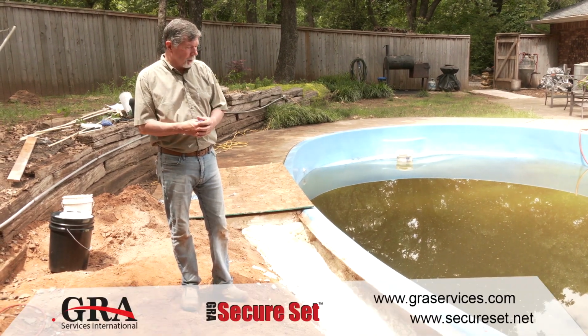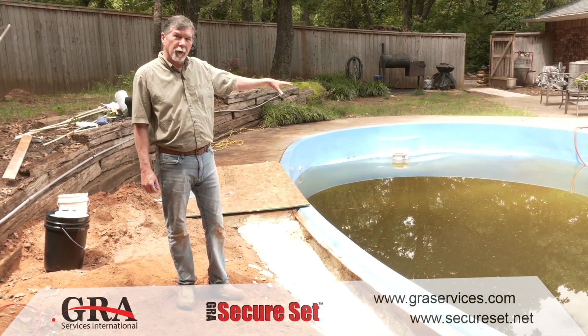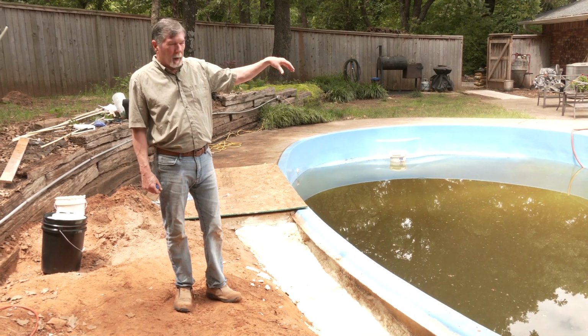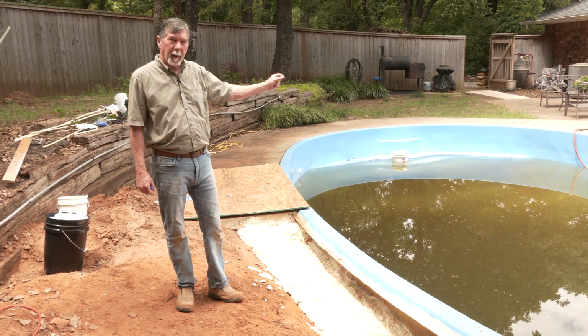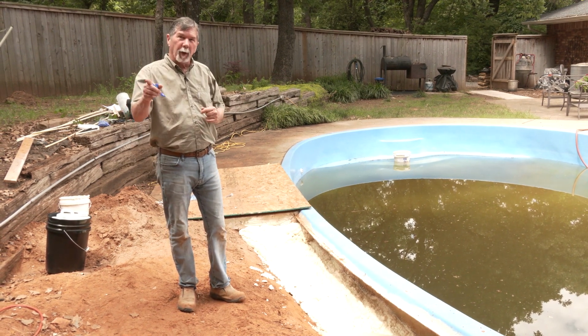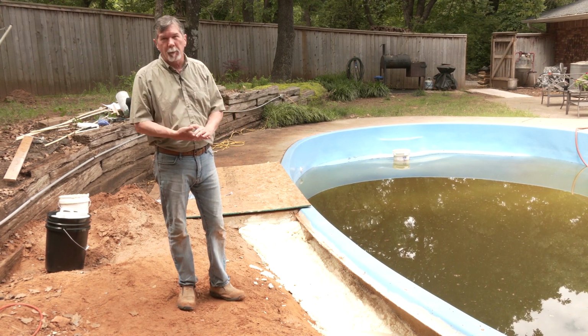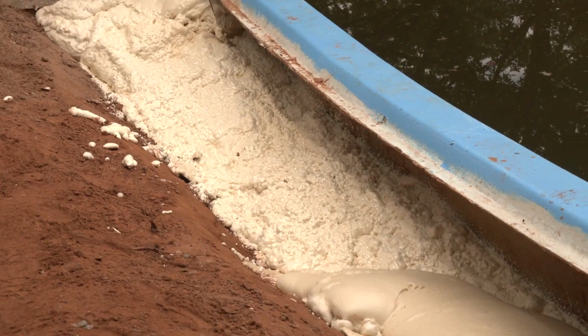The manufacturer, Doug, gave me another great idea. I'm concerned on my other returns on the pool about some voids behind them. And without having to cut a lot of concrete out, I'm going to drill a 1-inch hole behind them, use the spray foam to put down in there and fill that void so I don't have future problems with it. Real excited about that next part of this project. Glad this one's almost over.